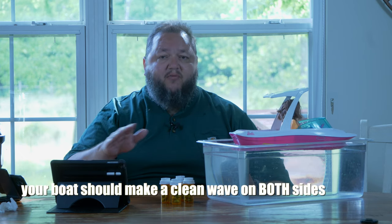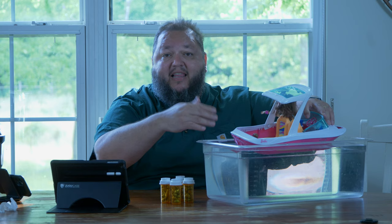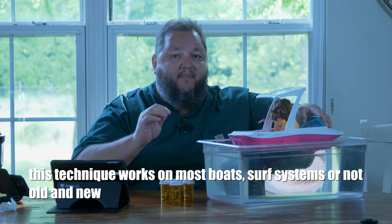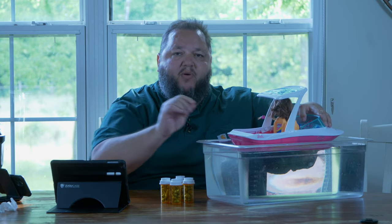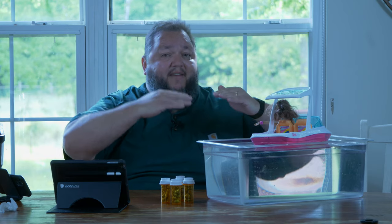The way I find the best roll is really simple. On most boats they should all provide a clean wave. If they don't make a clean wave, list the boat over and the wave will get cleaner. When you go towards flat, it'll start to get dirty. The best roll, in my opinion, go to where you have just a little bit of list to where the wave just cleans up — if you go back a little bit it's going to get dirty. You might say, well why don't you just go more then? It's not better. When you list over too much, the wave changes. When you just have enough list to clean it, usually you're going to have the cleanest face. When you list over more, you'll get like a double lip on most boats. My experience is the best wave is always as level as you can have your boat.